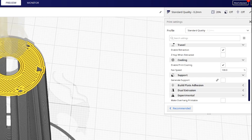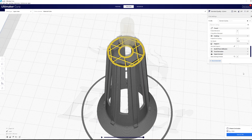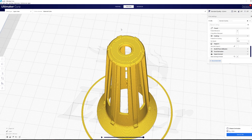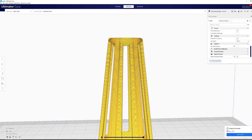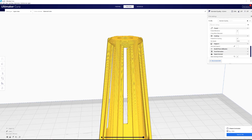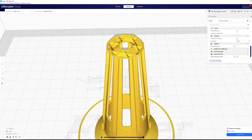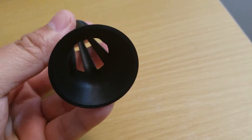What this setting does is target parts of the model that would be considered an overhang based on the overhang setting, and tweak the geometry just enough to allow the slicer's algorithms to avoid printing in mid-air. Obviously the drawback is that it does change the geometry of the print just a tiny bit, but for practical prints this might be a suitable compromise. As you can see here, the roof now has a little extra geometry — there's more of a cone-shaped structure underneath the roof compared to before. The change is subtle and doesn't affect the functionality of the print. In the preview of the layers we can see that it no longer prints on thin air, and there's more infill in the roof. I printed out this model and it's clear that there's no mess under the roof — the print came out clean. I'll show both of them for comparison.